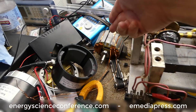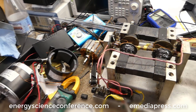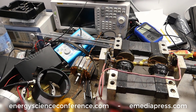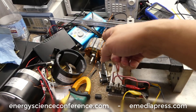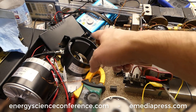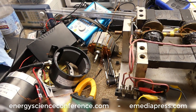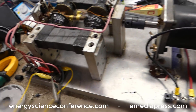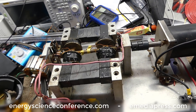This right here is one of the little scooter motors. Go to energeticforum.com and look up the three battery thread and look at what Matthew Jones and Tourian are talking about in there. This motor is normally a regular scooter motor, and when you rewind it like this you get it pulsing — it's off and on — and that's going to replace this steady DC motor so I can get to the same speed for less draw. That's going to increase the overall efficiency of the entire deal.